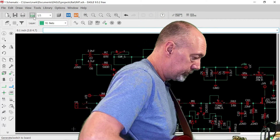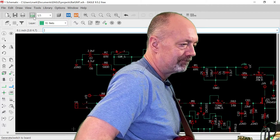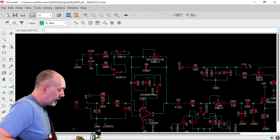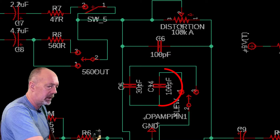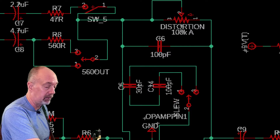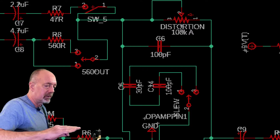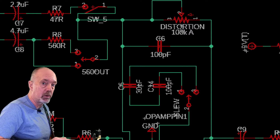Let's try them together. We're back to stock. Next let's try messing with the slew rate. I figured I went the wrong way with it in the schematic originally — I went from a 30 picofarad to a 1 picofarad. I think it was the wrong way to go because it increased the slew rate and the bandwidth and it squeals a bit. It's just too much for this circuit, so I went the other way and replaced the 1 picofarad capacitor with a 100 picofarad capacitor.